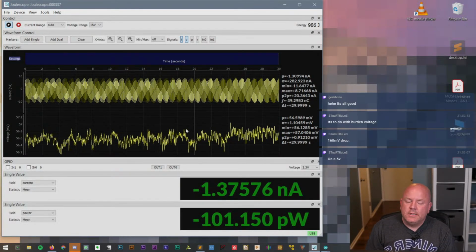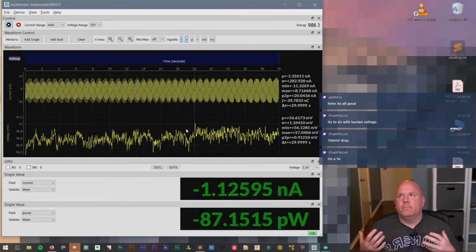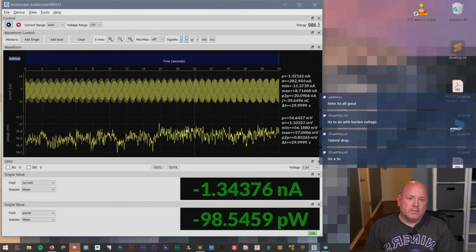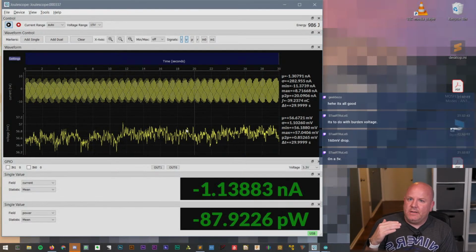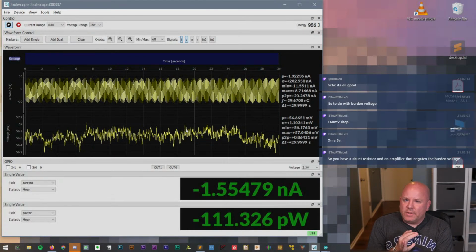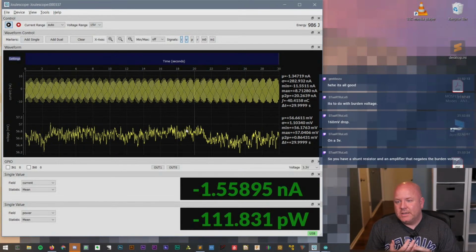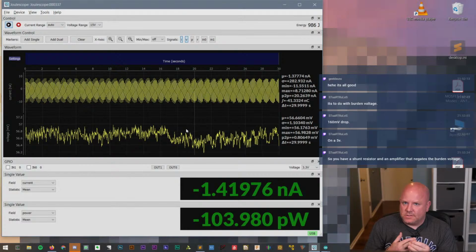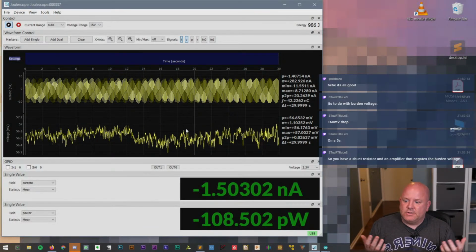analyzer for current. So where I was starting this comparison is, I wanted to say, well, compared to a multimeter, because I think a lot of us are going to say, well, if I need to measure current, I'll just grab a multimeter and then you're done. So a multimeter is somewhat of a gross measurement, right? It's relatively slow. It really gives you an RMS. It doesn't really give you a view of what's going on over time. And most multimeters have a ridiculously high burden. On the other hand, they're cheap and easier to work with.